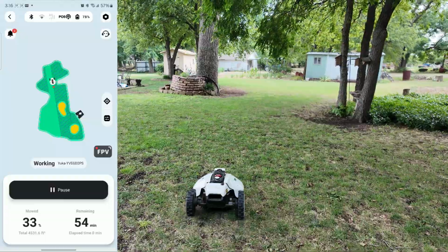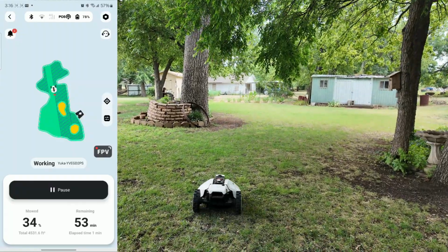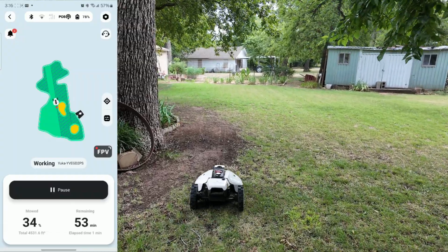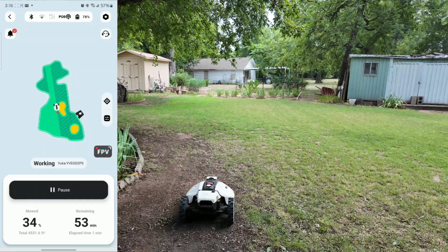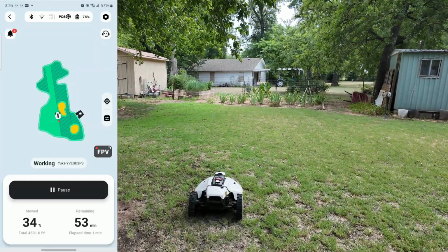If your robot is out somewhere with poor satellite signal, it is relying heavily on your RTK station. That RTK station needs as many satellites as possible. So when the robot gets under here in the trees and it has poor signal on some of the satellites, there's plenty of spare satellites to choose from.